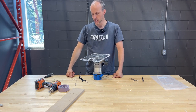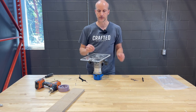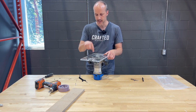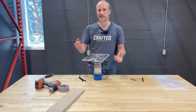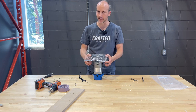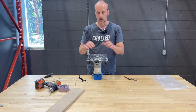Easy peasy! To recap: all you really need is your drill, your router, some small diameter drill bits working up to a larger diameter just slightly bigger than your mounting screws. If your screws are a little too short, countersink from the bottom for extra depth — but make sure you have at least a quarter inch of screw thread into your router, otherwise it'll break off the plate or loosen and shake around, which is a bad thing. You want that router secured to the base plate. You'll also need some tape and a marking device — the interior of a pen works wonders.